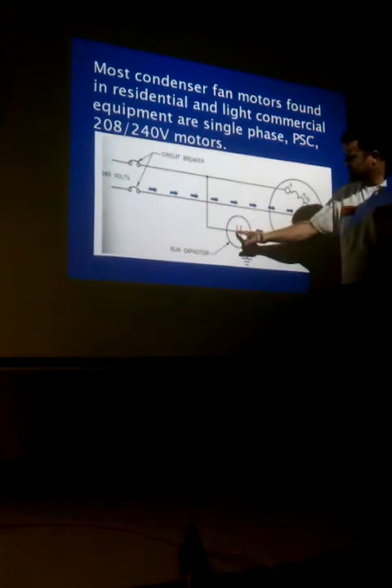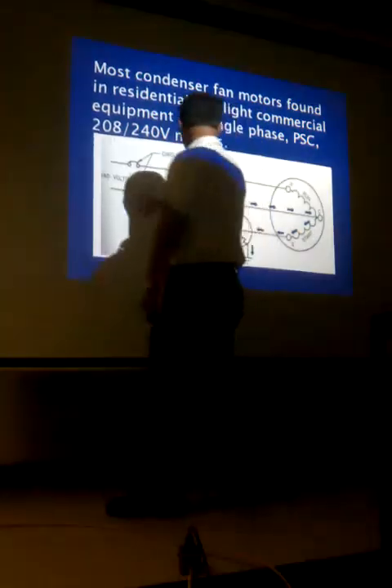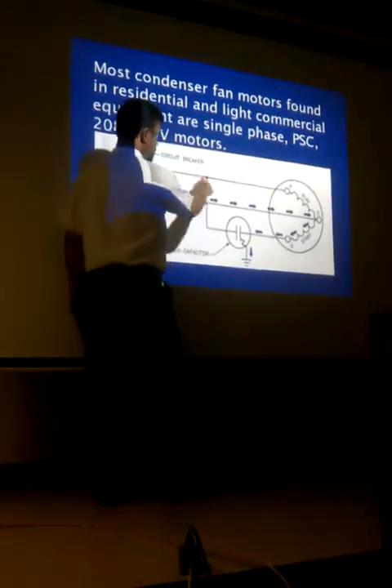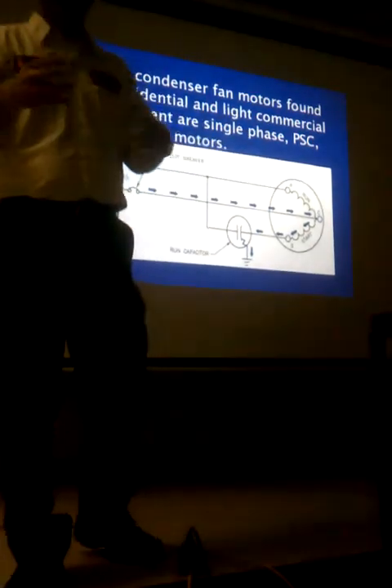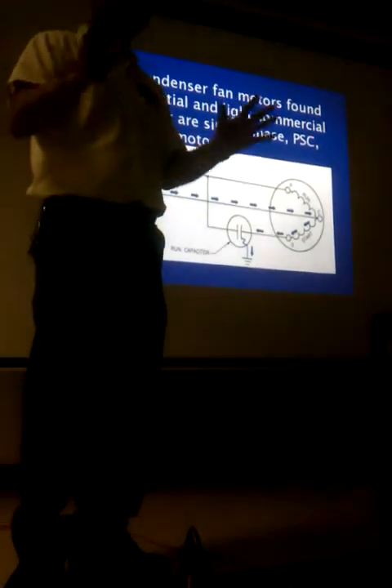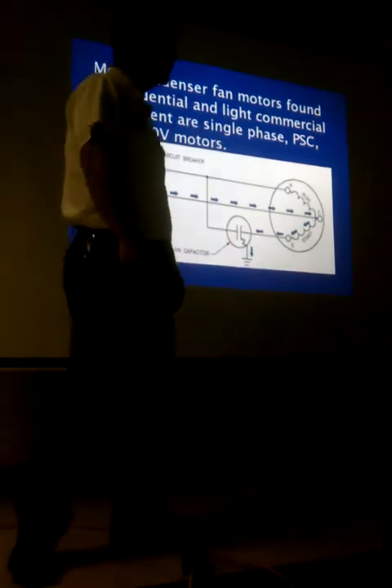If I had put the identified terminal on the correct side and it went to ground, then L1 would have gone right to ground. The breaker would have tripped, the fuse would have blown, and we'd be done. We'd come out and find a capacitor shorted to ground.